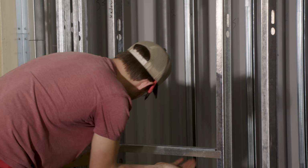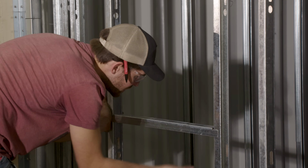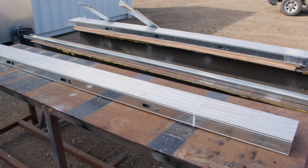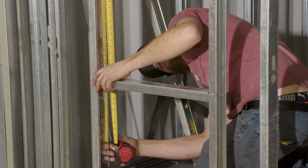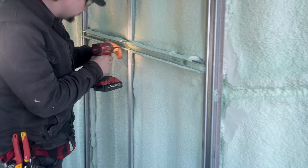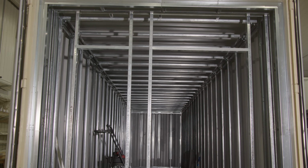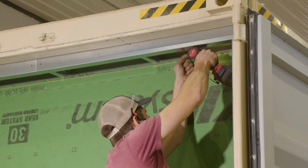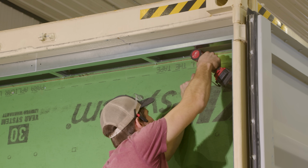One thing about steel studs is that the spray foam, as it cures, can actually push them out and bend and bow them a little bit. They're super straight when they come in the bundle, but they can flex a lot more than a wood stud will. So whether you're using stiffener bars or your exterior sheeting, ensure that all of these studs are on the same plane before your spray foamer arrives, to really make sure that the wall remains nice and straight after it's all cured.